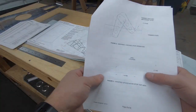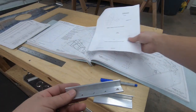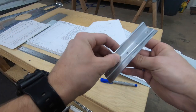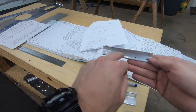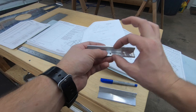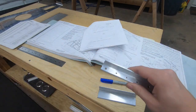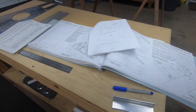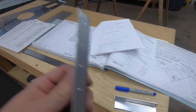I'll use that center line to line up the tongue portion and the center hole, then match drill the remaining holes from the existing piece onto the other part. I don't want to just flip this piece and match drill from the bottom — if I wasn't 100% perfect on the first holes, that imperfection would mirror to the other side. I really want to match drill to the top piece where it will live permanently.